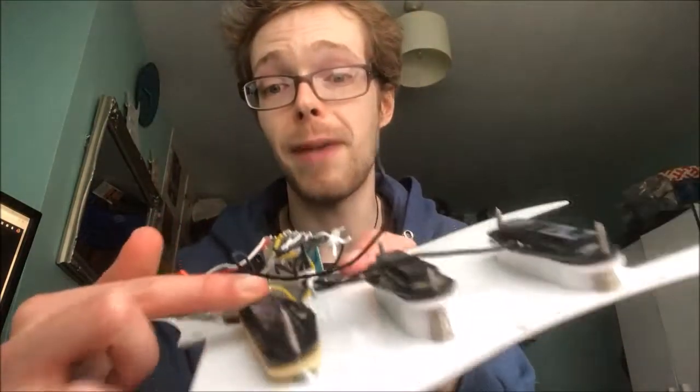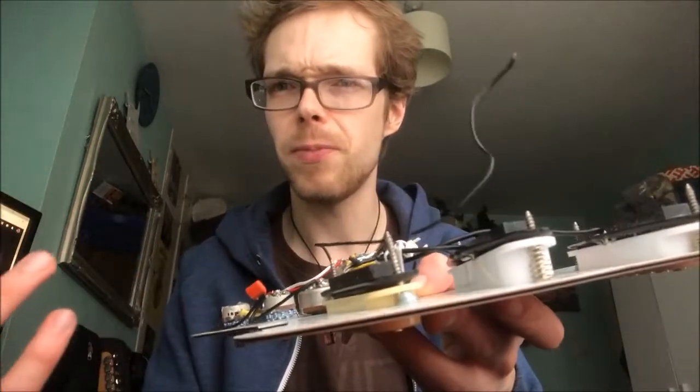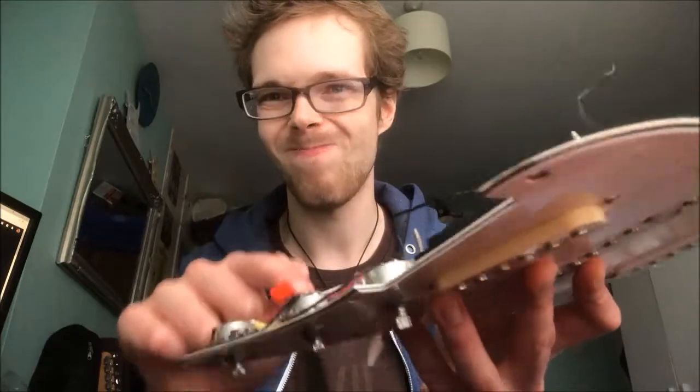And you've got a ceramic magnet as well to start with. They're really kind of, it has a brittle quality to it, ceramic. I quite like it on humbuckers, less so in single coils. It depends on the pickup and application, you know, or like gubbins. But I do think that 500k pots aren't good, aren't helpful. I would rather have 250k mini pots, and I'd be a lot happier with that than the 500k.